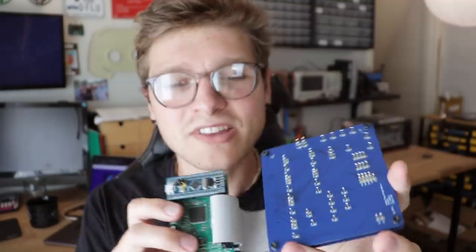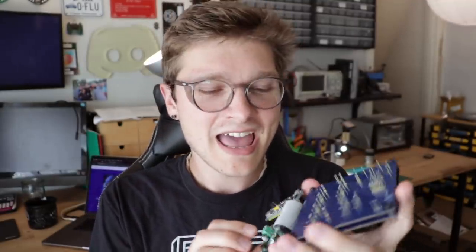And here it is. It was actually pretty easy getting this thing together. Aside from a really weird config problem that I had for the main controller board where it was running at like a third the speed that it should be, which ended up being the remnants of me changing some crystal speed stuff from a previous motherboard, and having a really hard time getting the blue pill programmed as a Blackmagic probe, for reasons I still don't quite understand, it totally works now. Everything is spun up and doing exactly what I expect it to.